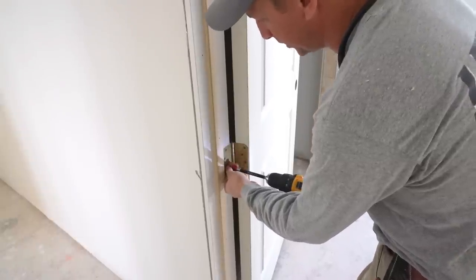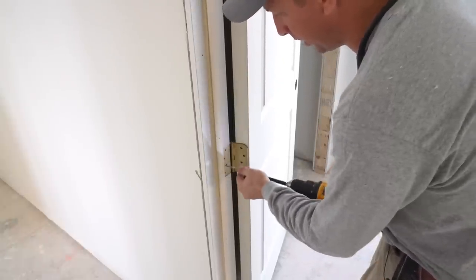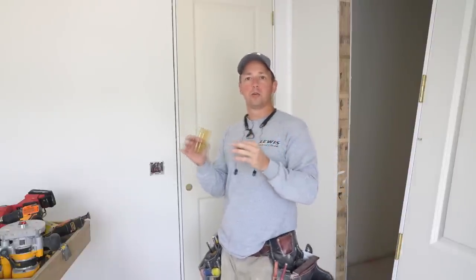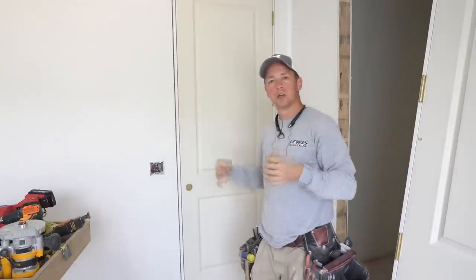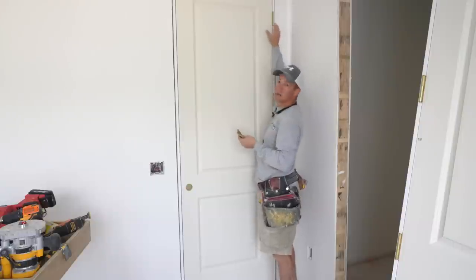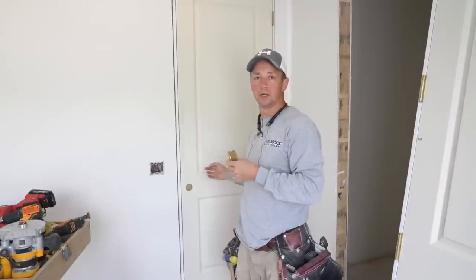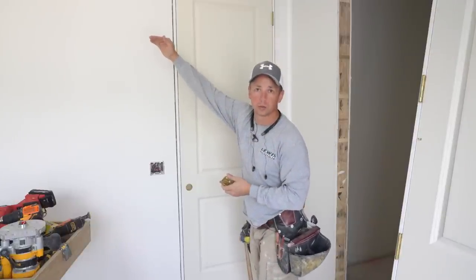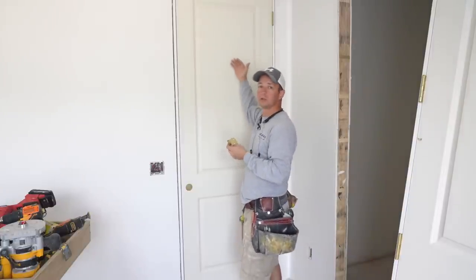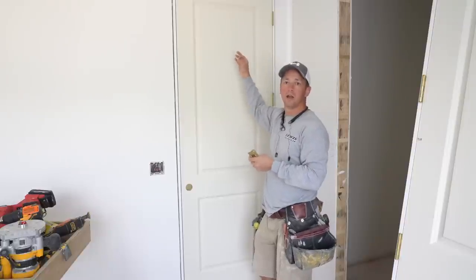I like to go ahead and install these screws behind the top three hinges. It's important to understand whenever you're setting doors — know which way the pull and the push is and where those forces are happening on the door. I put two shim locations at the top and bottom of the top hinge because the top hinge is very, very crucial, as well as the bottom hinge. All of the weight of the door is pulling this way, so if you're not secured up there very well with preferably a screw, that door can start to pull away over time. So it's very important to have that top hinge area shimmed correctly and fastened correctly.